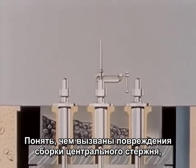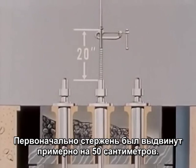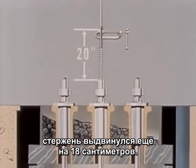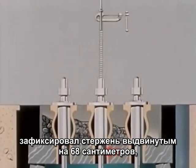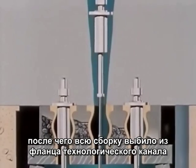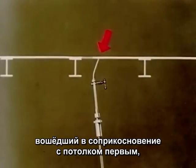Reconstruction of the movement of the central mechanism gives greater insight into the physical damage observed on the rod. Initially, the rod was withdrawn approximately 20 inches. As a result of the core jumping during excursion, the central rod was moved upward an additional seven inches. The water hammer pressure then bound the rod and tube together at its relative position of 27 inches. The plug and rod were accelerated as a unit from the nozzle by the high pressure. Upon hitting the ceiling, the handling tool snapped the threaded end of the rack.